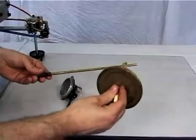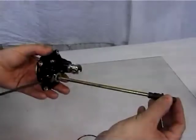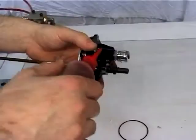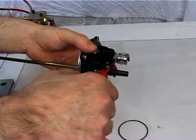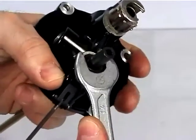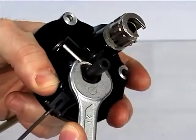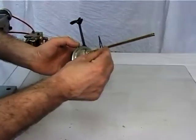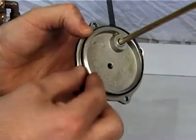Grease the air conveyor, figure 50, and insert it into the bottom, figure 13. Apply Loctite number 542 on the connector, then block it by means of a 14 mm wrench. Mount the O-ring, figure 38. When overhauling the tool, it is advisable to replace the O-ring.